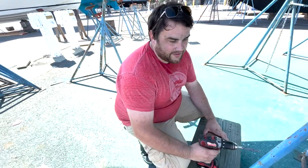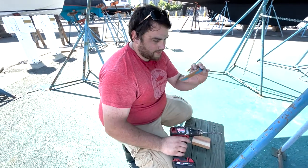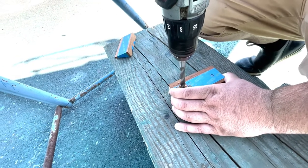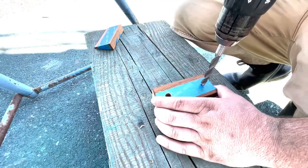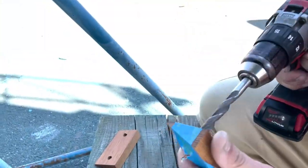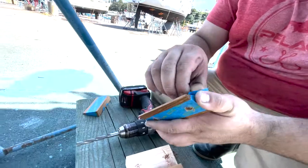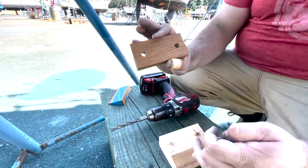So yesterday we talked about having wedges for the wind vane. My dad made these awesome teak wedges. So I'm drilling the holes for it right now to get the bolt holes to line up. So I'm going to do that here. Because it splits really easy, I want to make sure that it turned out okay. You can see a little bit came off there, but it's not bad. Nothing some 5200 won't fix, and there you go. That's one bracket made.